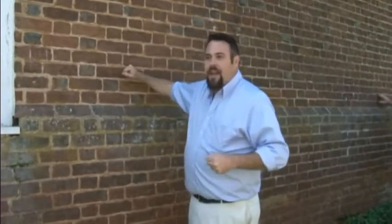One thing I would add: when we were talking about joint profiles just a few moments ago, there tends to be a thing in the restoration industry where you re-point and then beat it with a brush to make it look old. That will certainly tie your wall together, maybe a little bit better. But every time you strike a joint with a metal tool, there's a certain amount of cream — or laitance — that's going to come to the surface. That laitance is going to help seal up that mortar joint. If we knock it off, we're basically increasing the capillarity — that water-sucking action. So it's going to fail quicker — maybe half the lifespan.